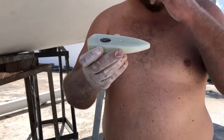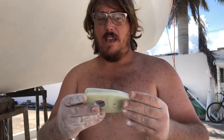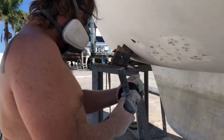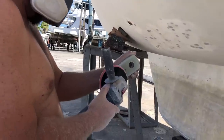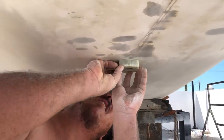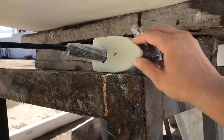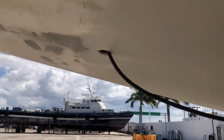It's just a wedge to make sure the depth sounder stays flat on the hull — a very expensive, overkill wedge. We've been carrying around a bit of G10 material for a couple of years and use little pieces of it constantly for various projects. I don't think G10 is overkill at all, considering the original wooden version was totally eaten away by teredo worm. We epoxied the wedge directly onto the hull, and then later we 5200'd the transducer onto the wedge.